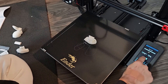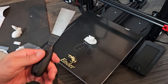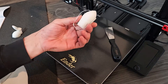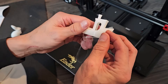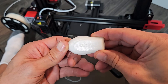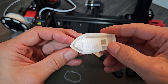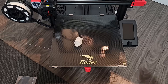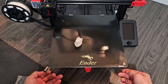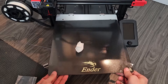Looks like it's done. Press Confirm and turn the printer off. Go ahead and get your scraper. Let's see how hard this is to take off — oh, that's pretty simple. We've got some stuff on the edges we can just pull off. You can see the details on this print — looks nice and perfect. If yours printed out perfect like this, comment below. Also, to clean your bed, slide it out using the magnetic clips and clean it off.